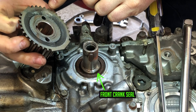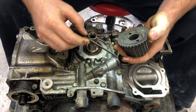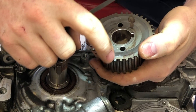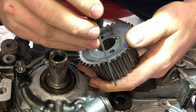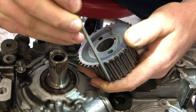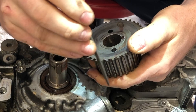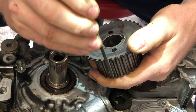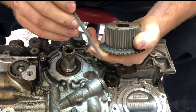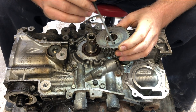I don't think I damaged those teeth or mushroomed them enough to worry about it. If you're concerned, this is a miniature file set — I can see where I touched that tooth and I think it's perfectly fine, but if you're worried about it just take the file and make sure it's nice and square. Barely touched it, so there's no massive damage here at all — I just nicked it with the screwdriver. Take your time, don't mash these up, and you'll be fine.